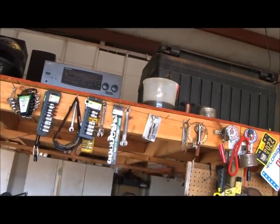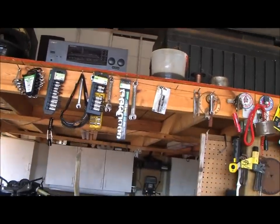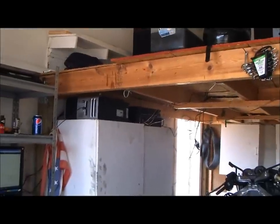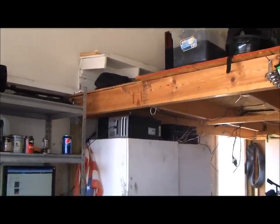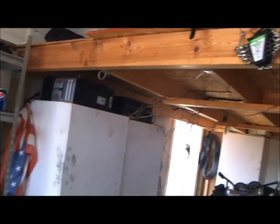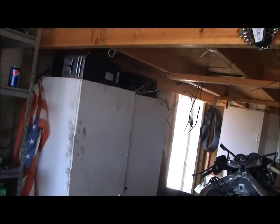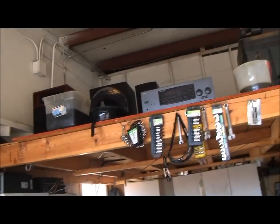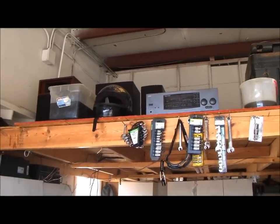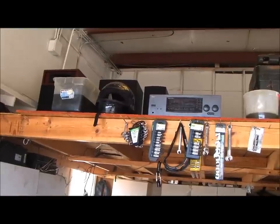I tried to give you a better demonstration — when I first checked it a while ago while it was playing, it was at 150 degrees in the finals section of that amp. For comparison, I don't think I've ever seen that Carver over 105 or 106 degrees. Hopefully that was helpful to someone, because apparently a lot of people don't know not to go below the ohm rating your amp can handle.